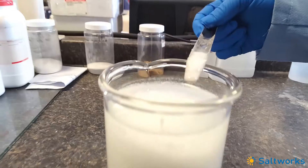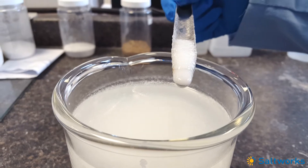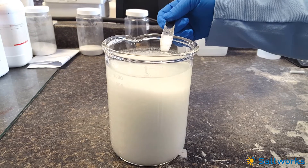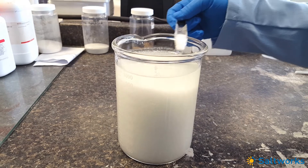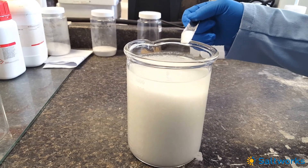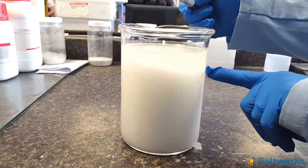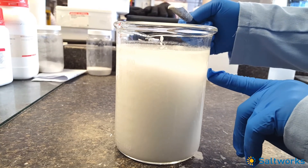Here are some solids forming. Our objective is that it's always beneficial in a ZLD system to remove as much solid mass as possible at the lowest possible cost. These two brines were generated from a membrane system — just a combination of reverse osmosis and EDR, the two most popular desalination technologies. Now combining them, almost 85% of the beaker is a liquefied solid.